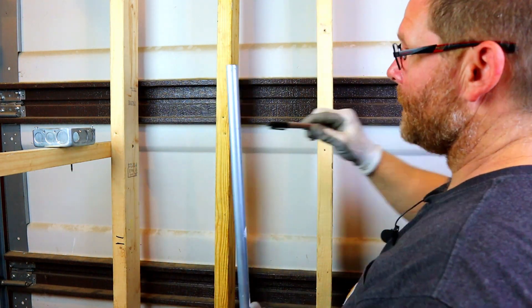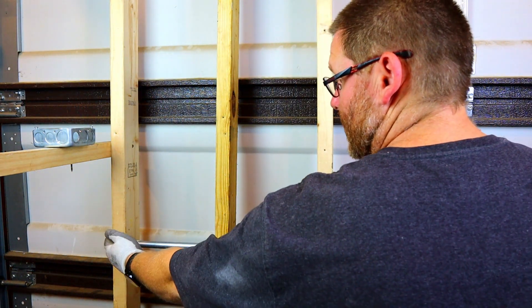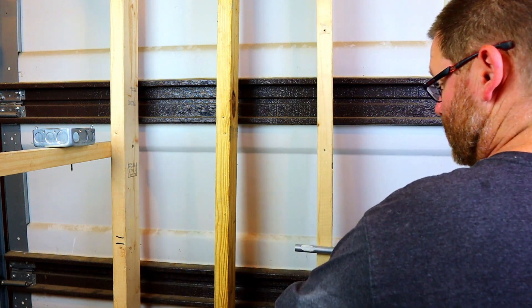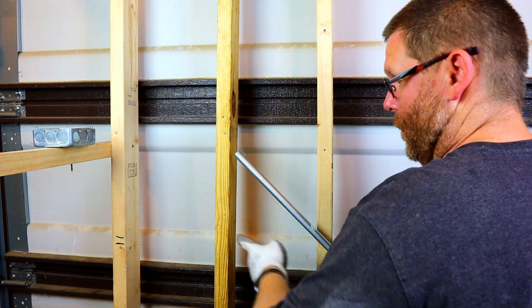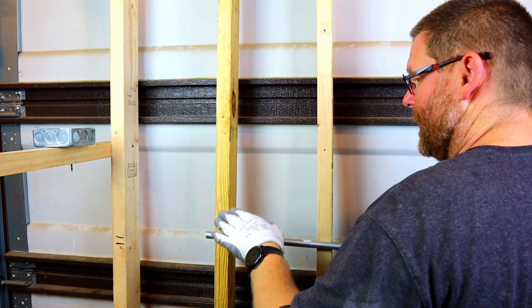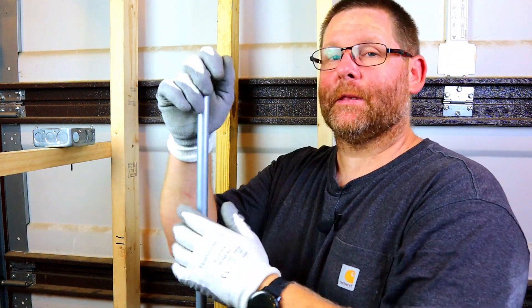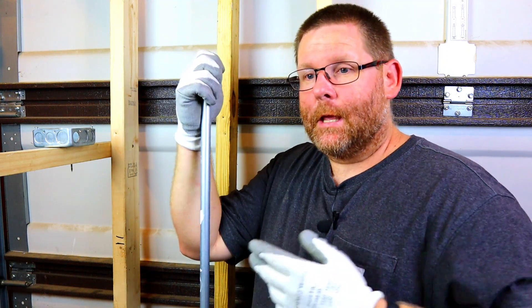I'll put my sharpie right here so I can find my mark. Obviously in reality the conduit wouldn't be right here — it could be coming 60 feet and this is the ending point, but the box is up there. If it were a regular offset you'd just offset straight up. I've seen some people offset more and then roll it in and bend it in — let's not do that. This method works for any size conduit.